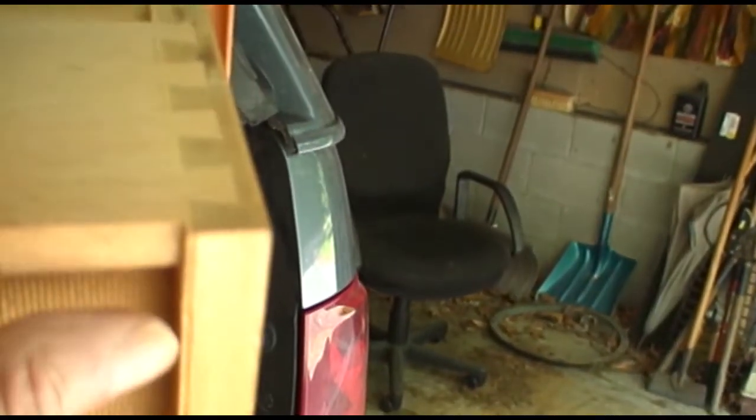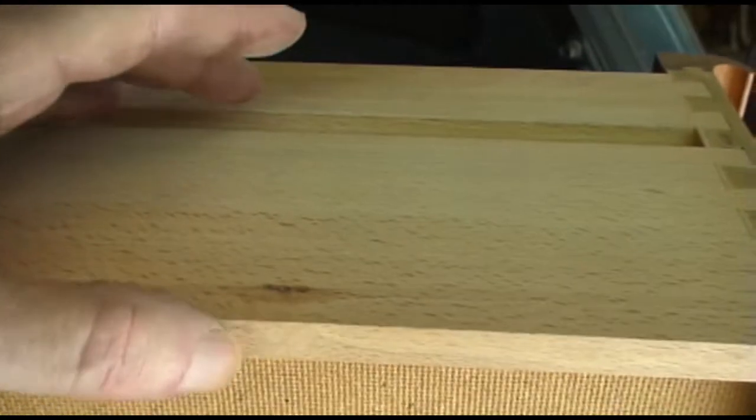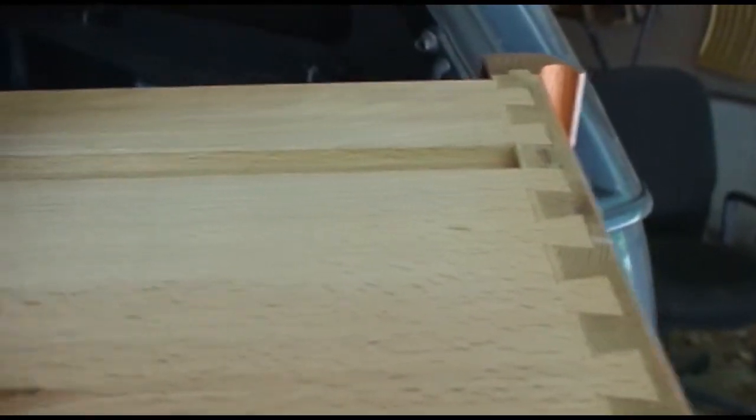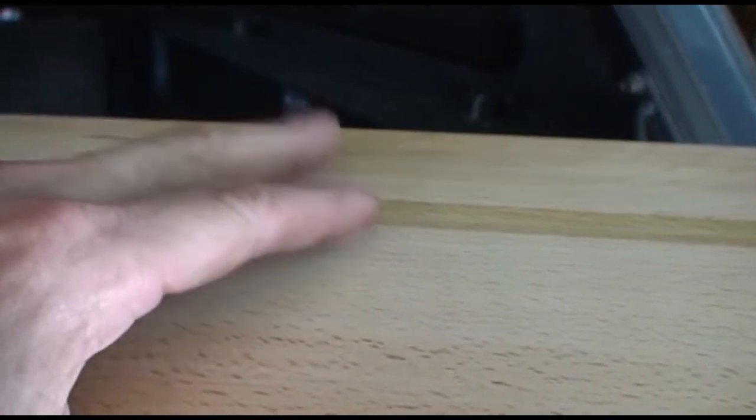So we'll bring them in the shop, and the first thing I'm going to have to do is make a jig, because the front of the drawer extends down an 1/8 of an inch, and I want to use a router and a fence to cut everything referenced to the bottom so that everything is uniform, and when I reference to the top, so that when I go to install them I can make a template that'll work on all of these drawers.